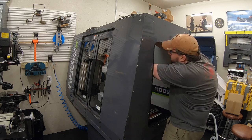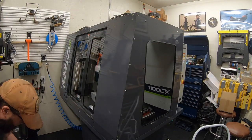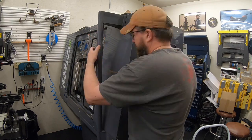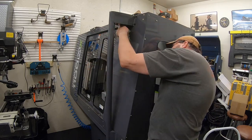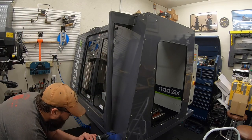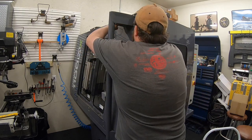The other issue is the hardware. They talked about the bolts and the nuts going from the outside to the inside, and then you may have to make some adjustments on the inside if the hardware is running into your door. So I had some quarter inch Allen head bolts or hex head bolts that had a really thin head, and I put them from the inside out. They were black hardware, so they had a black nylock nut, so I put the nylock nut on the outside, and that way I had a very thin hex head on the inside, and it didn't interfere with the doors at all. So that's what I would recommend: it doesn't come with hardware, so if you have to pick up your own, I would pick up hardware that has a nice thin head, put it from the inside out, and it doesn't interfere. If I had tried to put the nut on the inside, I think I would have had more of an issue.